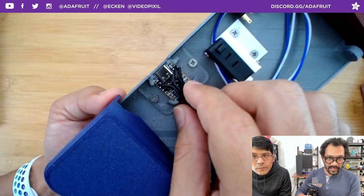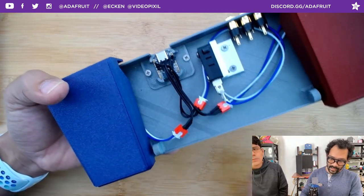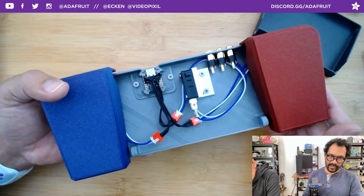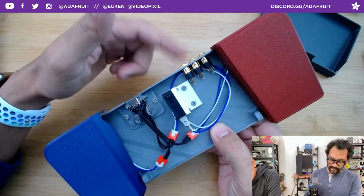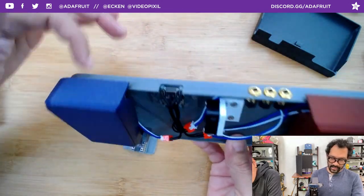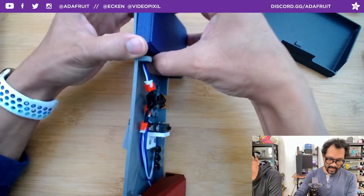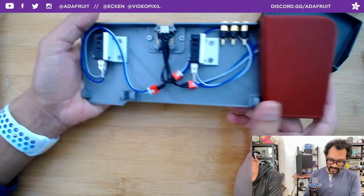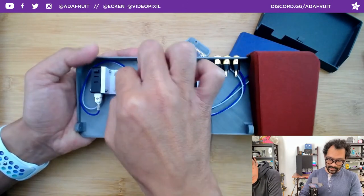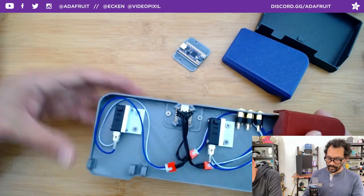You can connect two wires on the inside of the pins and one on the outside on the castellated part, giving us three ground connections to easily hook everything up. There's also enough room for the small TRS jacks to be mounted right next to each other. We're really happy about not needing any springs — you have a nice amount of space on the base. The wires can just loop around and look elegant, packed away without looking like a nest.